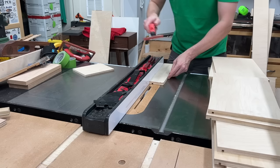What you'll see me install on site is going to look rough — I'm actually remaking these drawer fronts, but they won't be ready in time for this video. We tried sanding everything back to bare wood and starting over, but it just doesn't look right. Back on site, I went to get the face frame prepped and ready for paint. I also needed to add some filler strips for the drawer slides to pad them out flush with the inside of the face frame.